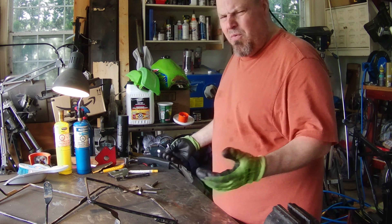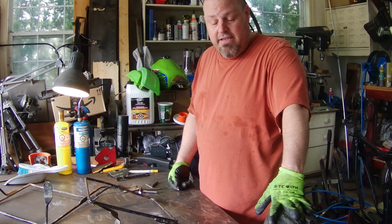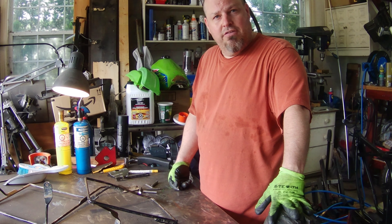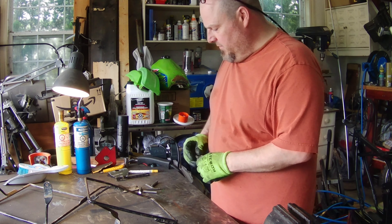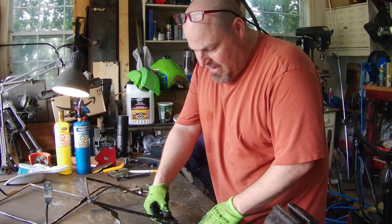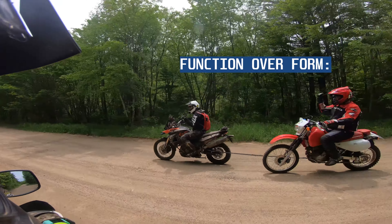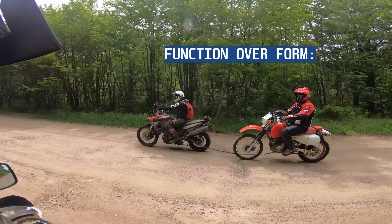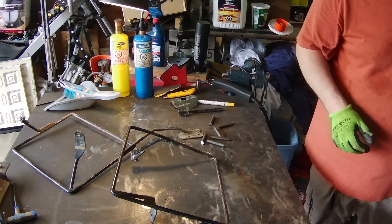So it's easily welded up. Like, if Colin — it's on the channel — did the True Northeast Trip, and he rolls into some town and needs something welded, we can weld it. Not every place can weld aluminum, not every place can straighten a welded tube. This stuff is shit simple. Let's get the welding gloves back on and start getting some welding done. And yes, they make clamps for this — don't care. That's what welding gloves are for. The beauty of flux core is you don't have to spend a lot of time cleaning the metal. A little paint on there? No big deal, it's going to burn through. I will move the grounding clamp onto something a little more substantial, just to make sure I get a good ground.